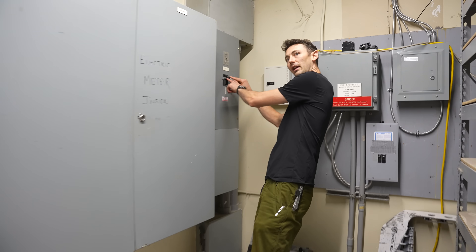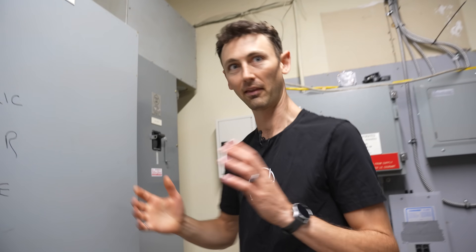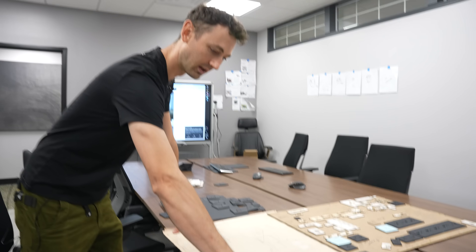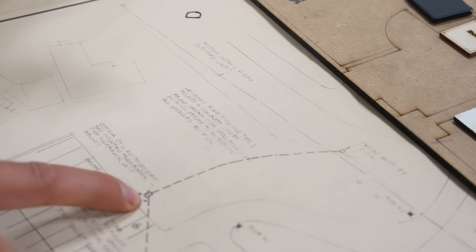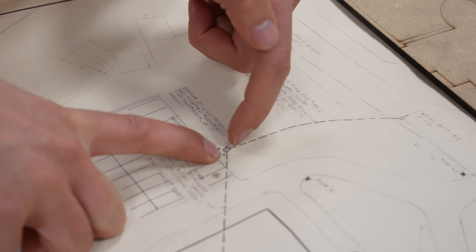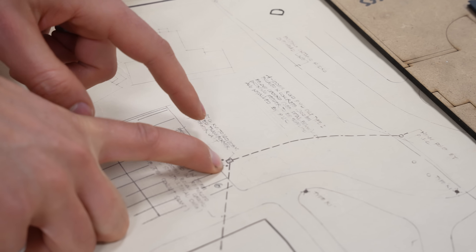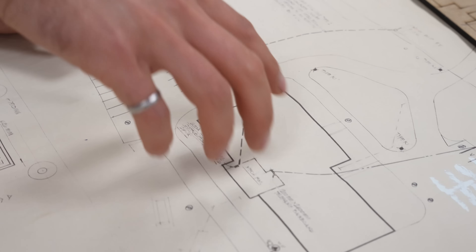The problem is power. You see this right here? If you zoom in really close, it says 600 amps. These are the original electrical layout drawings — 600 amps. There's the hydro from the street. That goes underground to the pad-mount transformer at high voltage at 27,000 volts, then it drops it down to something usable in here.